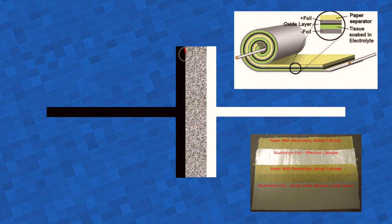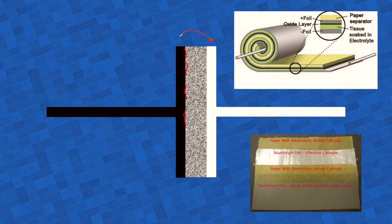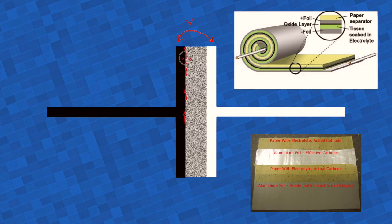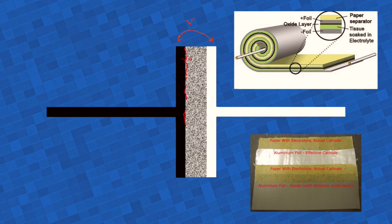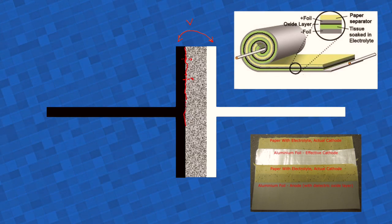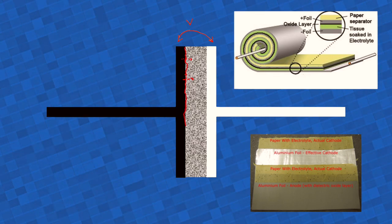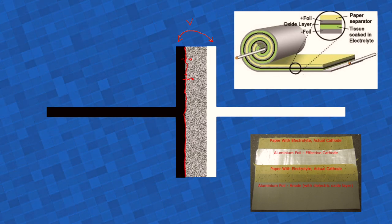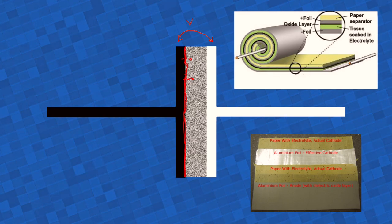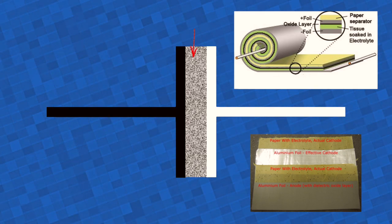Reforming means reforming this oxide layer, which may have holes in it. We want to apply a voltage differential in a very controlled way, starting at very low voltages and currents, such that a trickle of current passes through but mostly the chemical reaction reconstitutes and heals the holes. That's basically what reforming is — very carefully applying a voltage differential in several steps so the oxide layer reforms and seals off the terminals from passing direct current.